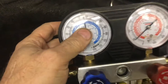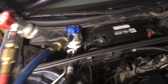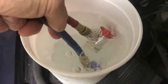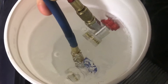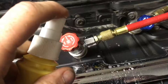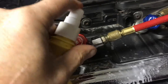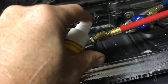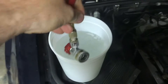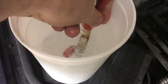So it picked up the big leak, but not the small one. I have pressure on these gauges, so they should not leak. All the valves are closed, but you can clearly see this one needs to be tightened up a little more — you can see it in the bucket of water. If you took soapy water and sprayed it on this connection, which we're going to do next, I'm not seeing any bubbles coming out of this. Usually soapy water bubbles will start to hiss out where the leak is.